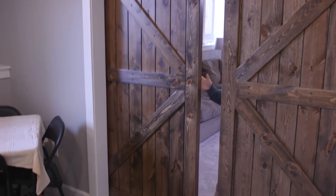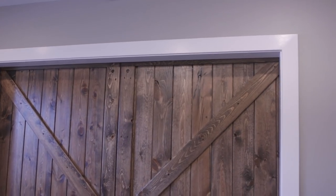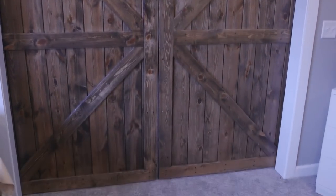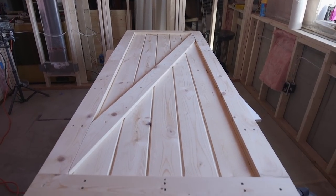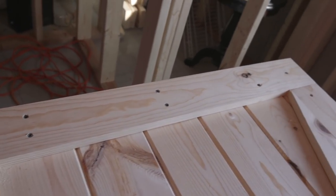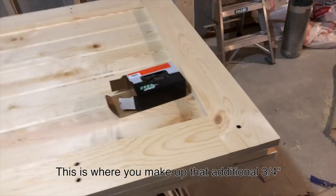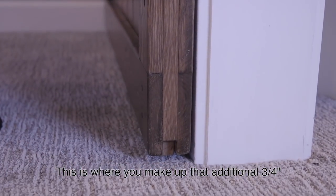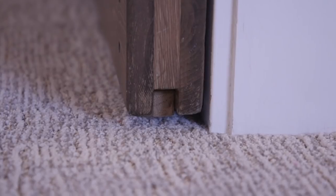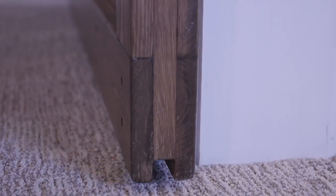We finished both sides of our doors so that when they're closed and we're in the guest room area, the folks in the guest room have a cool view too. How you frame your doors is really personal preference — on ours we wanted an X pattern when they came together. Matt chose to do his a little differently. I recommend having a board across both the top and bottom to band all the tongue-and-groove boards together. I also recommend putting the bottom framing board lower than the bottom of the center boards to create a channel — we made a little steel L-bracket and mounted a piece of oak underneath to ride in that channel, so the doors don't wobble, sway, or bang against the wall.